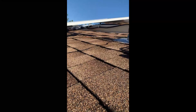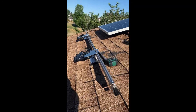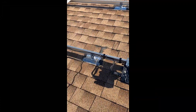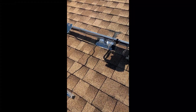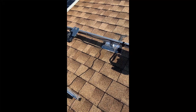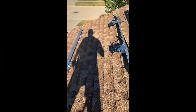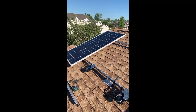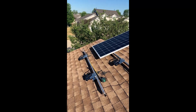As you can see, I've got no cables hanging — you don't want any cables hanging and you don't want any extra slack. Set up your cable ties in a manner that ensures that if a cable drops or isn't attached over time, you don't end up with extra slack dropping the cable onto the roof. Once you get your microinverters laid and ready to go, then it's plug and play for solar panels. I hope you found this video helpful — thank you!